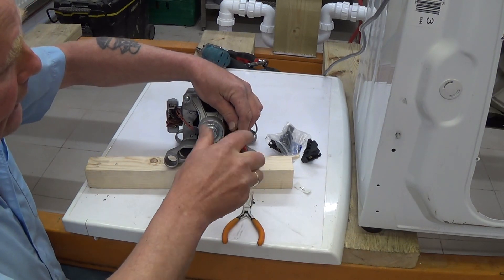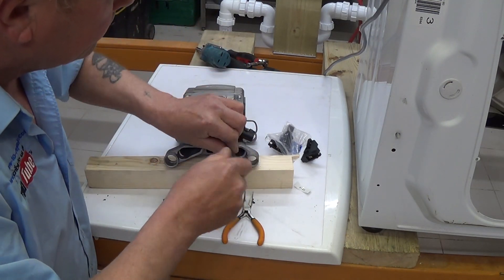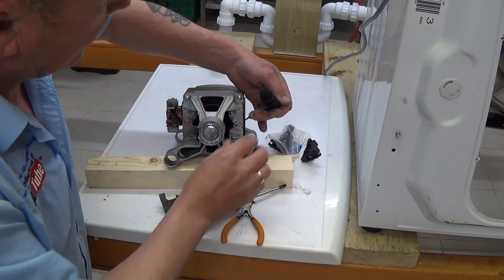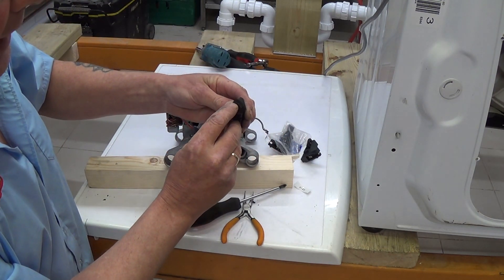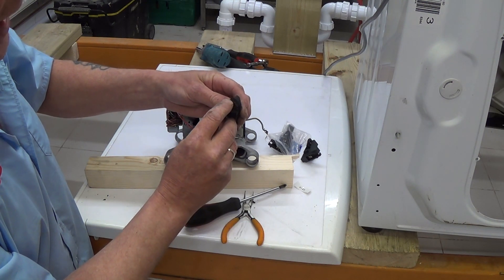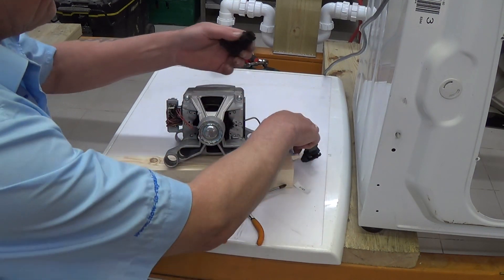There is a little bit of meat left on that carbon brush, but I suspect the other one is the one that's worn completely out. And as you can see, this is what I was on about — the carbon brush is very carbonized. When I say carbonized, it's a charring burn. You can clearly see that this is completely and utterly worn out.